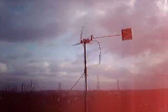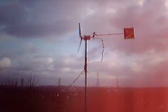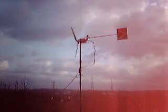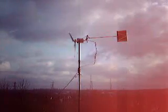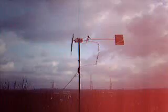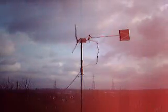The wire that comes off the back is on the broken end of a fishing rod. I used to have problems with the wire rolling up on the yaw, maybe doing 360s which was causing problems. So I put that bit of fiberglass rod up there from a fishing rod. What happens is if the wire gets a chance to wind up around the pole, it bends the fishing rod like a fish would. And obviously the fishing rod wants to straighten again. So when the wind drops, the fishing rod unravels it and unwinds the wire from the pole — and therefore that's maintenance free as well.